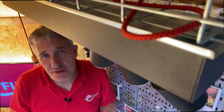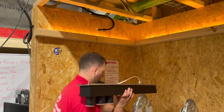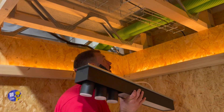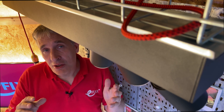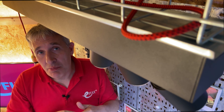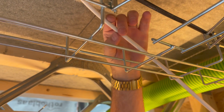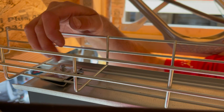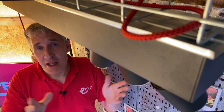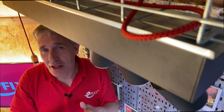The electrical installation for the Hue pendants is incredibly simple — just like any other domestic light fitting. You just need to bring a line, neutral, and a protective conductor to them. Bags of wiring room in there. These are designed to go against a flat ceiling so you'd typically have plasterboard above. We've made some modifications to work with our open plan ceiling and cable basket. I'll leave a link in the description showing how we went through our installation process and conversion, and another link for the video showing how we made our filament pendants.